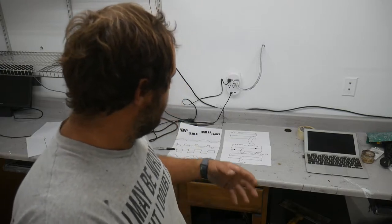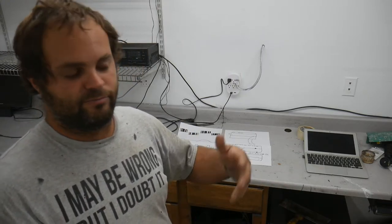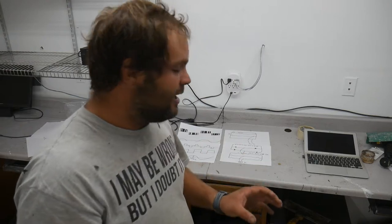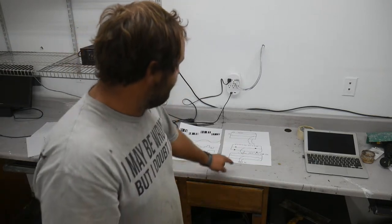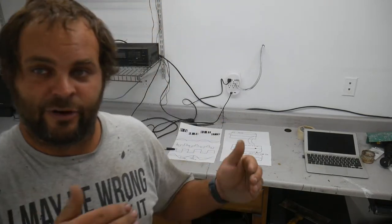If it's a 12 volt inverter, 12 volt to 120, and you're trying to get 200 volts DC in your DC bus, that's a step up of, I can't do the math in my head, 12 or 13 times, something like that. Anyway, the point I'm making is the voltage that's in that DC bus is directly relational to the input voltage. The inverter can't change that.